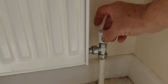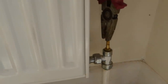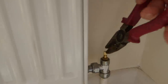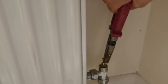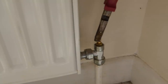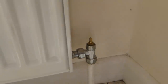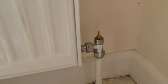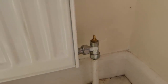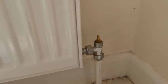Normally what you find is you've got what they call a lockshield valve. You just pull the cap off, or if it's got a screw undo the screw and pull the cap off, and that will reveal the valve. Before you turn this valve off, just remember how many turns — mine took eight and a half full turns. Yours may only be one or two turns. This valve is used for balancing your system, so when you turn it back on make sure you turn it the same number of turns you turned it off. That way your system will remain balanced and you won't end up with rads hot or cold elsewhere in the house.